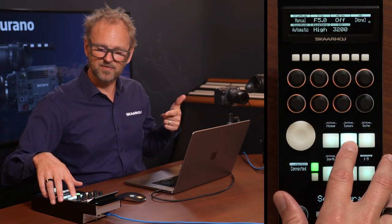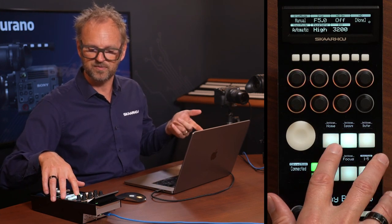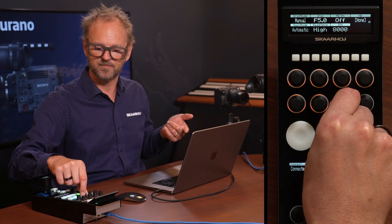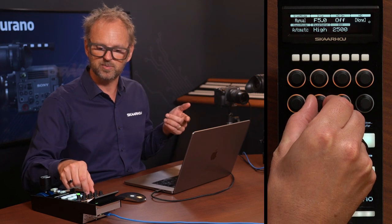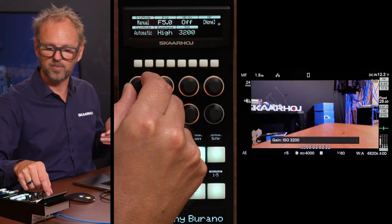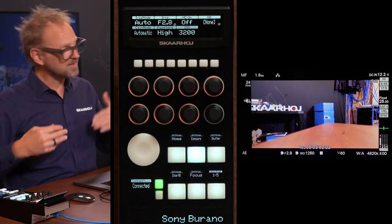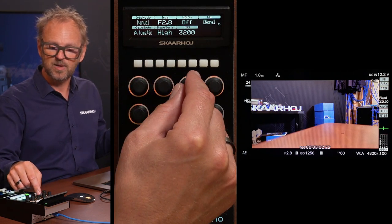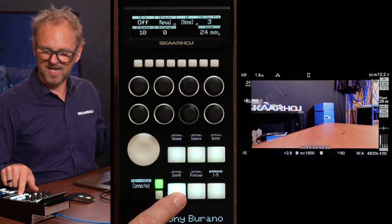Some of these settings are replicated in the exposure menu as well as the shutter menu. In the exposure menu, the ISO setting is here — also on the home screen — at the exact same knob. We can adjust the ISO setting of the camera and choose between low and high base sensitivity. We can choose which gain mode we are working on, whether the iris is manual or automatic. The moment we change it to auto, notice how we receive feedback from the camera that the iris has changed to f2.8. We also have ND filters on and off here — you can even hear the motor.